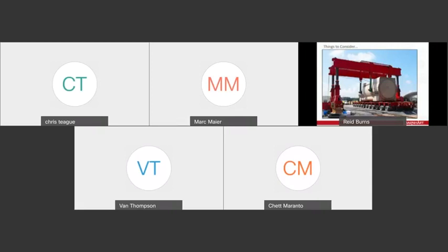And the header beam that you're using should also be properly checked to ensure it has adequate strength. And again, I can't stress enough, if you're side shifting the load, don't just look at the capacity of your system when it's in its initial static condition. You've got to analyze it both when you've lifted it and you've slid it over as far as you need, and make sure that you're analyzing the shear, bending, deflection, all the local effects that can cause problems if the unit's not sized correctly.